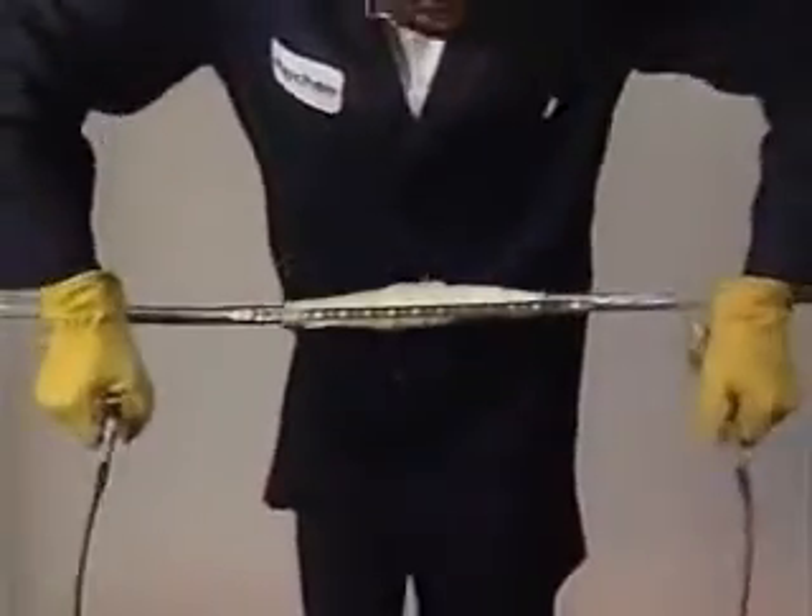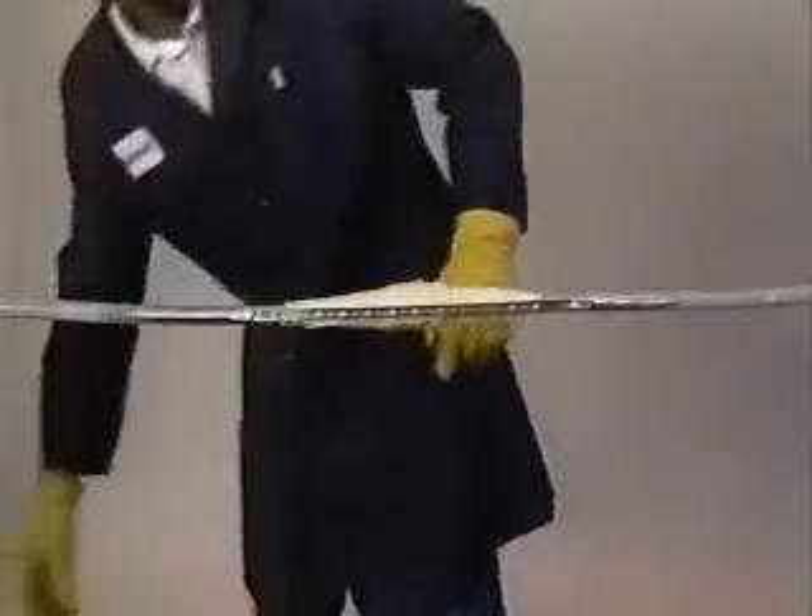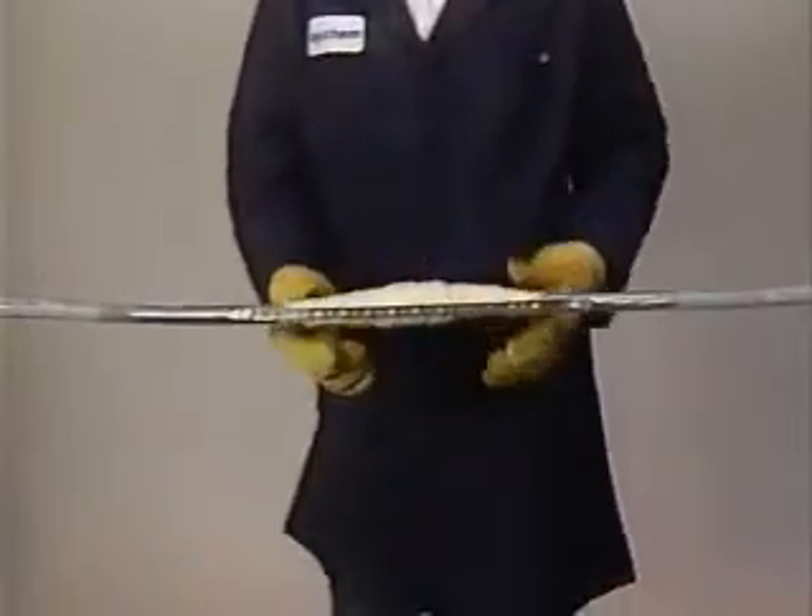Install the permanent bond, and then remove the temporary bond. Now, using minimal tension, apply two half-lapped layers of DR tape. Overlap the abraded lead sheath by about one inch on each side of the opening. Be sure that the DR tape covers the ends of the bond bar.